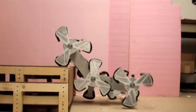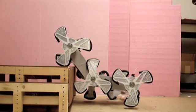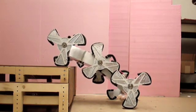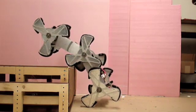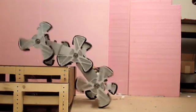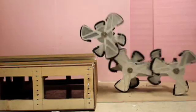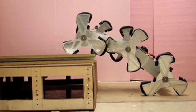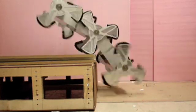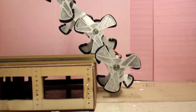With an active body joint, DAGSI WEGS can overcome an obstacle height of 13.4 inches. Initially, the robot flexes its front end up to help the foot land on top of the obstacle. Once the front wheel legs are situated on top of the obstacle, the front body segment flexes down, lifting the middle wheel legs up, allowing them to get a foothold on top of the obstacle. The robot then moves forward, and once the center of gravity is on top of the obstacle, it slowly flexes its front segment up again to allow the rear legs to come up.